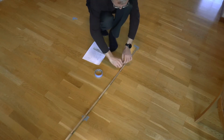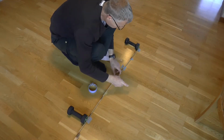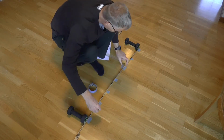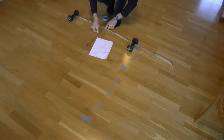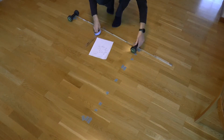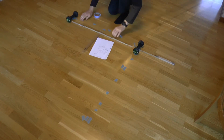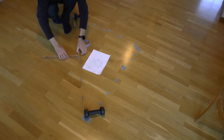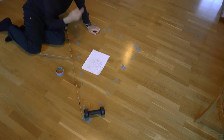This is the deepest intake in the leech, one third up from the foot. The hollowness is shaped with a bendable object, using some fitness products. The foot is shaped in a similar way, around the middle point of the foot. The luff is shaped to cope with the stay sag and cloth stretch into a hardly visible S shape.